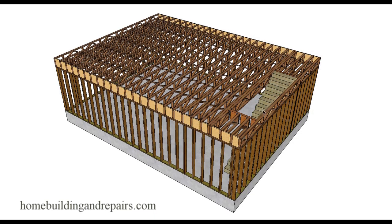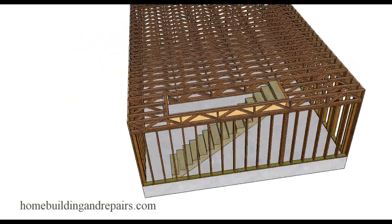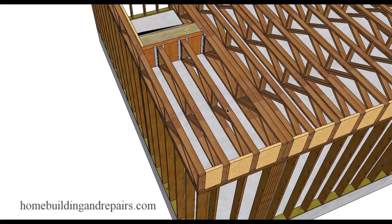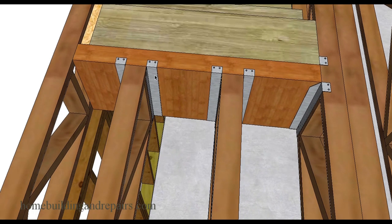Here's another idea: you can switch the direction of the stairway and use more of the standard sized joist that you could purchase. With something like this you might actually be able to use 2x12 or 2x14 because the span isn't going to be very long. You could get rid of the trusses. A double truss here, a single truss with a beam - sometimes you can use a truss, but that would depend upon the engineer. You would use top flange hangers most of the time.